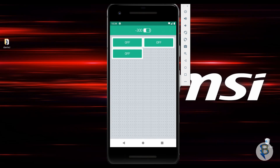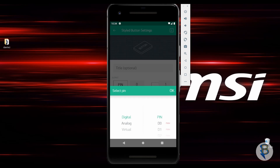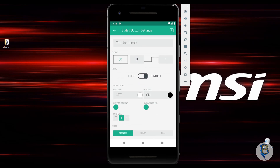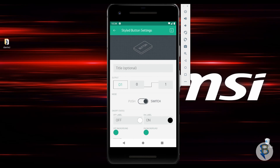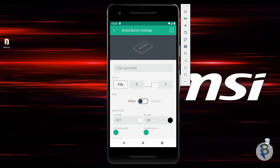We will select the number of devices and add a switch. Let's switch the first button — click the pin. We can use pins D1, D2, D3, D4. So we can use D1 and set it as a push button. If you press the button, the output will toggle.